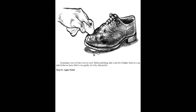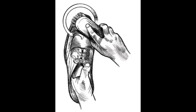Get started. Use a stepladder for easily reachable windows, an extension ladder for the second or third floors. Anything higher, find a professional. If using an extension ladder, call in a lackey to hold the ladder and pass you supplies, and run for coffee. Come to think of it, before you start slathering, check windows for cracks, chips or areas of missing putty. Repair as needed. Techniques, outside.